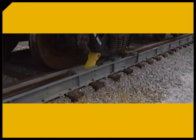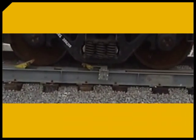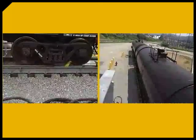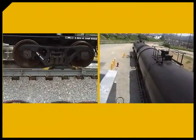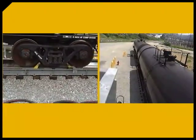Two steel arms are built into the carriage assembly. The arms lower as the CUB moves into position below the rail car bogie and then rise to lock the truck frame securely into position. Rail car movement is achieved instantly in either direction. The CUB can pass below rail cars without grabbing a car, grab a car on the run, or grab a car and switch direction.